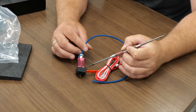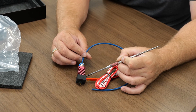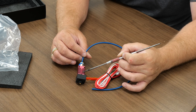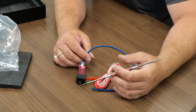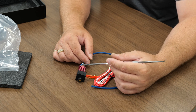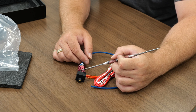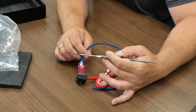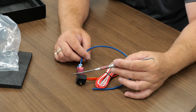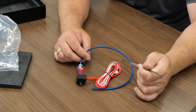When that tube sitting on the nozzle lifts away, the filament will start to push past and seep through. You might not notice at first — your prints may start to be under-extruded, or you'll see weird blobbing or zits. Mostly they'll be under-extruded and you'll hear clicking as it gets worse. If it gets too bad, that filament can seep out and create what we call the 'blob of death' — a huge ball of filament on the end of your hot end.